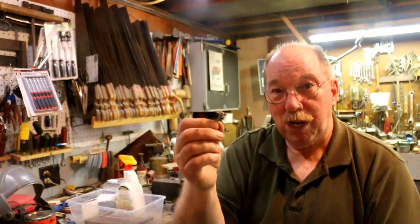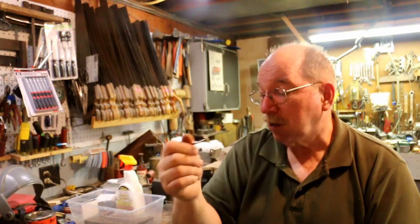These little Dremel wheel guys — for their size they're about the most expensive wire wheels I've ever bought. Tiny little things, but Dremel makes good products. And the wires still come out of them no matter what I do. So wear a face shield. Have your son wear a face shield. When you first start a wire wheel, don't stand in front of it — it's going to fling wires at a high rate of speed and they tend to stick right into you, whether your face or whatever part they happen to hit. I think an apron is probably a good idea for a young person starting out. A leather apron wouldn't be outside the pale — just one more layer of protection that the wire would bounce off of.